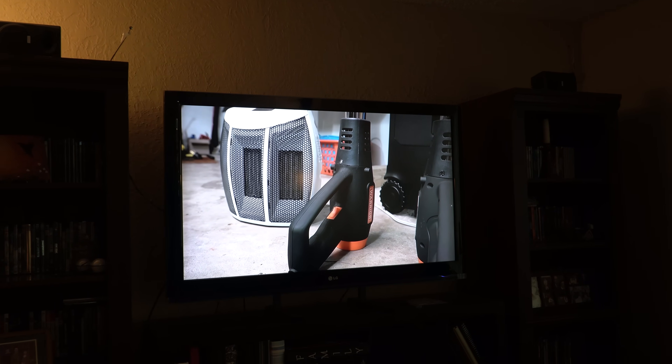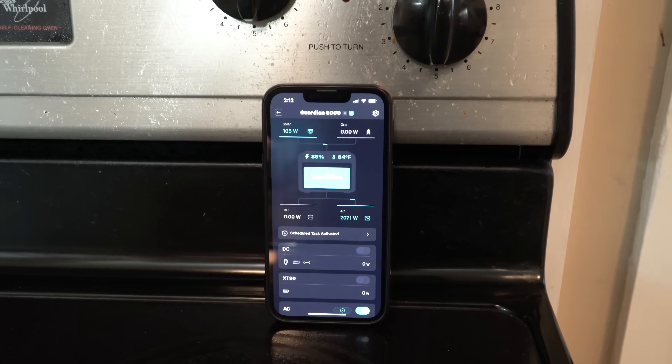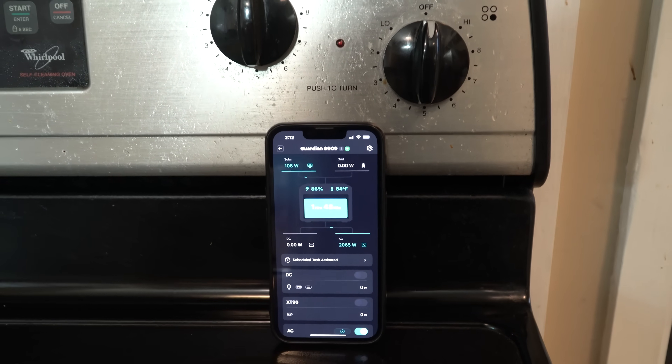We're back with the entertainment system, and of course the light on. Microwave's back on, entertainment's on. We're looking at 2,000 watts — a couple hundred lower than the max. The main thing I'm trying to do with these two circuits is to maximize my solar input and use of the battery, and just shave the power that these two circuits with the big television, microwave, and refrigerator use — run all those from solar. There's a way to do this in the app that I'll talk about in a minute, which helps me protect my electronics and get maximum solar usage out of the 800 watts of solar input that I have.